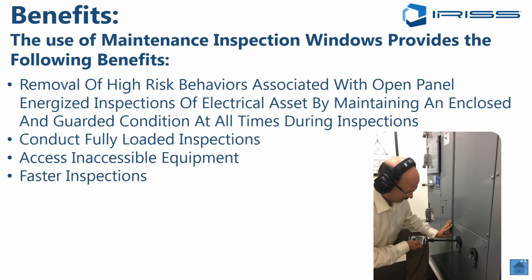You'll be able to perform much faster inspections. When the maintenance inspection windows and ultrasound ports are embedded in your equipment, a single person can walk around the facility in no special form of personal protective equipment, and they can do the inspection in a fraction of the time that was required before, when you were opening doors and panels and having to wear full PPE, arc flash suits and hoods, etc. Much less manpower is required. Again, one-man operation versus a 2 or 3-man operation when you're doing energized and open panel inspections.